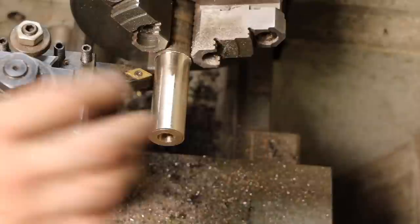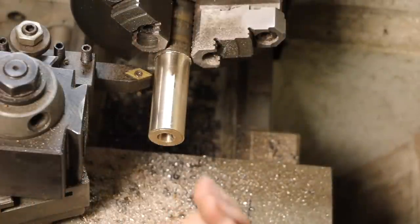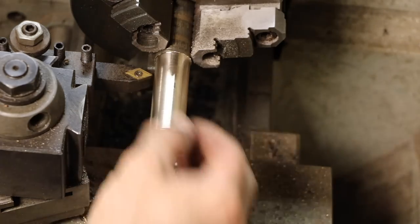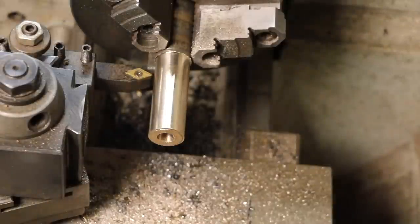I'm going to leave some grooves in here for the epoxy so that I don't end up with a smooth bonded epoxy surface against the wood. The wood is rough but the bushing is so smooth that it could end up sliding out. So I'm going to make some grooves for that epoxy to key into.